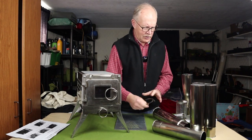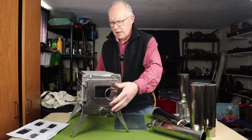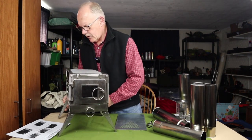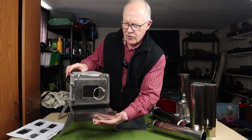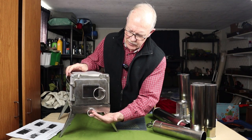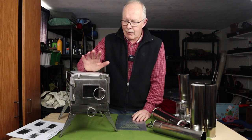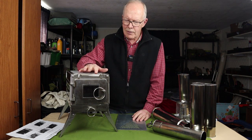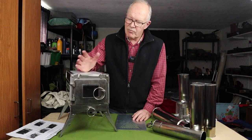One section of the stovepipe is different from the others — it has the attachment point for the back of the stove, with a rectangular hole where it hooks in. There's also an ash pan, which is quite nice as it makes cleaning out easy. The ash pan also doubles as the draft control for allowing air into the stove. The stove does not have a damper in the pipes themselves — I would prefer to see a damper, but apparently according to the website it's not necessary. You can buy aftermarket dampers in that pipe size if needed.